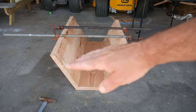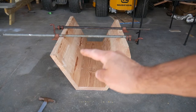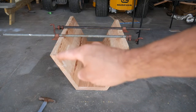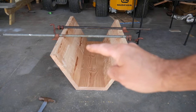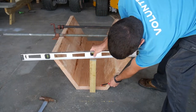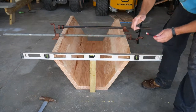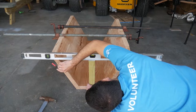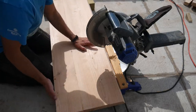I have these pieces rough cut to how high they are going to be and I have them held in place with two clamps so that I can measure from the base up. The internet says it should be 1 foot from the base to the bars, so these boards will be roughly 1 foot 3 and 9 sixteenths inches long to make it 1 foot from the base to the top. I cut a piece of wood to measure 1 foot, set a level on it, and marked each side where I need to cut. Here I'm going to cut the side walls down to the proper length — these are going to be 3 foot 5 inches.